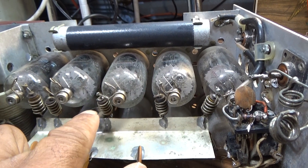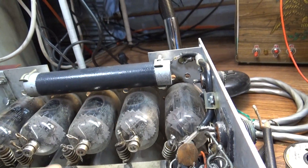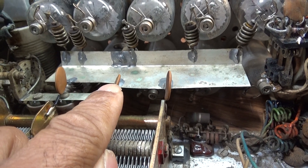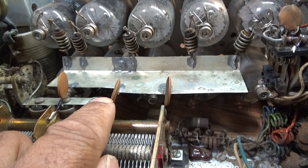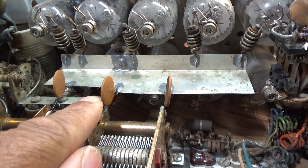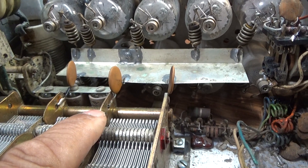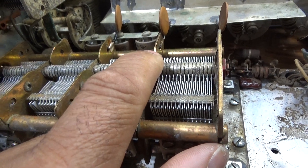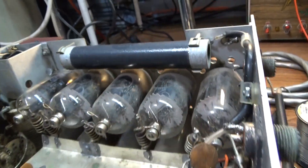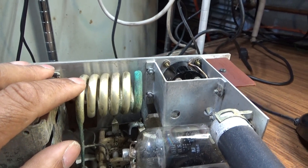What the PI circuit consists of — let's start with the tubes. The tubes have DC high voltage on them, and the RF comes out of the tubes and goes into a blocking cap. It's called a blocking cap, or sometimes a DC blocking cap, because it blocks the DC, so the DC stays on the tubes and can't go past the caps. These caps let the RF go through, so the blocking caps do their DC blocking and the RF only comes out. Then the first thing it goes into is the tune cap, which is this variable here.